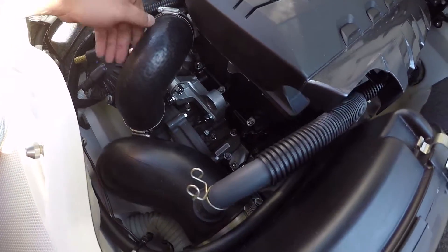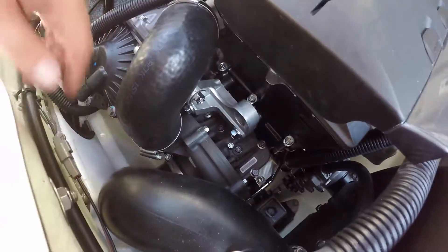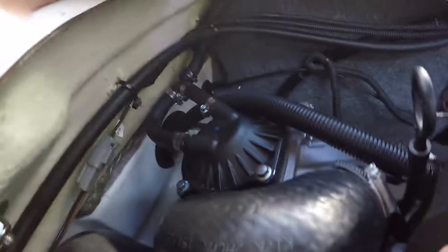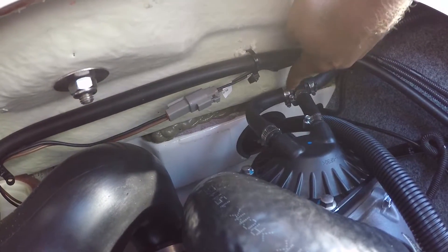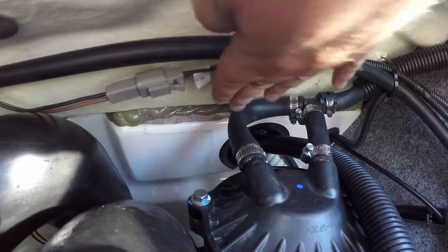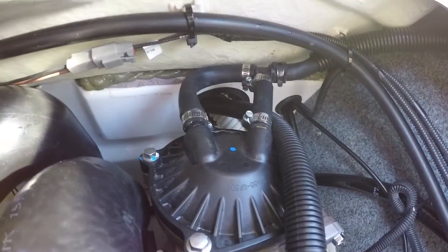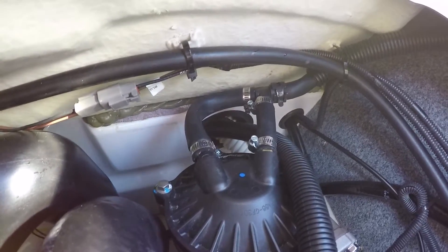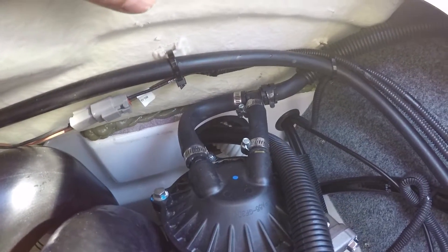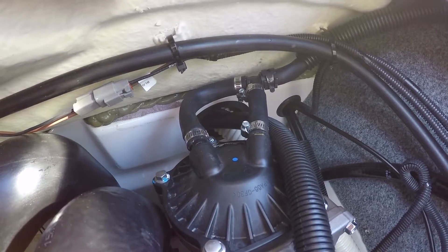I've got my pipe back on. Make sure you position your hose clamps where you can reach them easily with a screwdriver — rotate them a bit if needed. I've got all the lines in. I did a T-fitting here for now but I'm going to change to a Y-fitting because I don't like the bend. For the sake of testing, this will hold me over until I get the Y-fitting ordered, and eventually I'll probably run another line out through the hull for another pisser. That concludes how to install an SVHO intercooler and swap out your SHO intercooler.